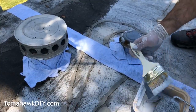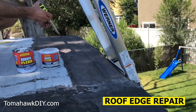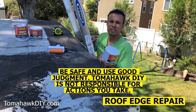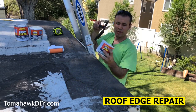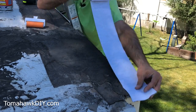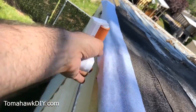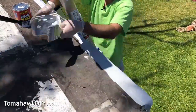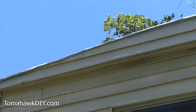Around these vents I'm going to use a 3-inch brush to help apply it. I'll take my tape measure and see where my 10-foot roll is going to come to. While you're working at the edge of the roof, make sure you're being absolutely safe — I'm not going to be leaning over the edge of the roof; I'm on the ladder and we'll move it to where I need it. Peel off the first few inches of release liner, get this lined up so there's some on top of the roof and some hanging over the edge. You can see up at the edge where it wrapped over — we put the waterproof tape and the rubber flex liquid coating there.